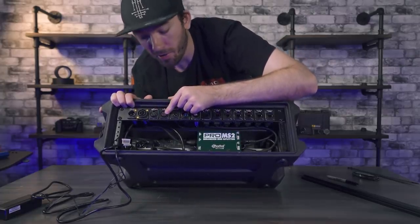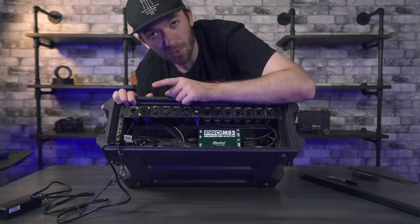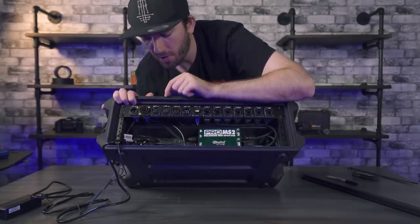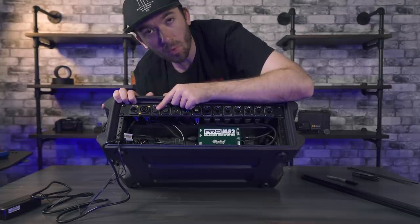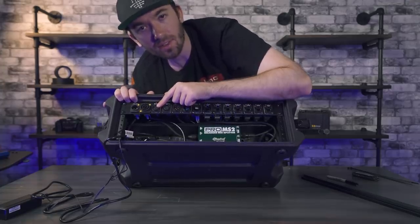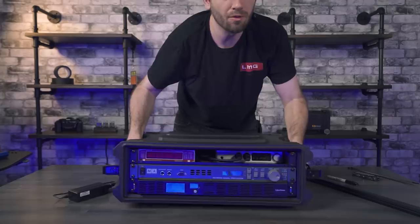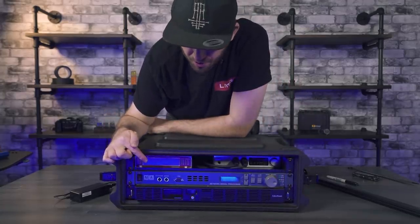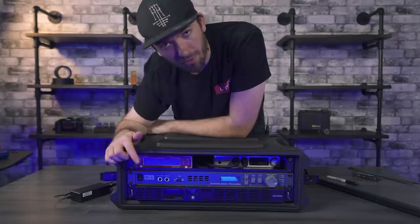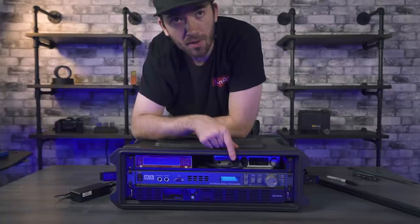Continuing on to our time code, let's talk about this for a second. We have two time code layers, like left and right, or one and two, whatever you want to call them. So time code number one comes into here. It then goes directly to the Rosendahl MIF, the MIF 4 over here. The MIF 4 has an LTC output as well, so it buffers it and then relays it. That output then goes over into input one,